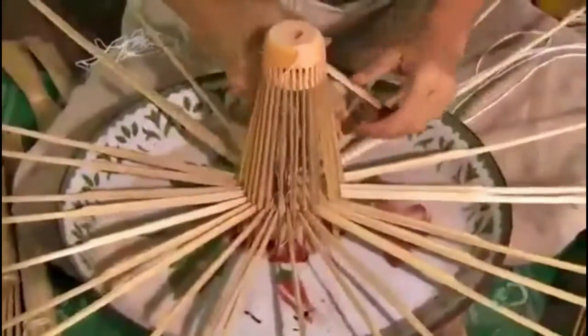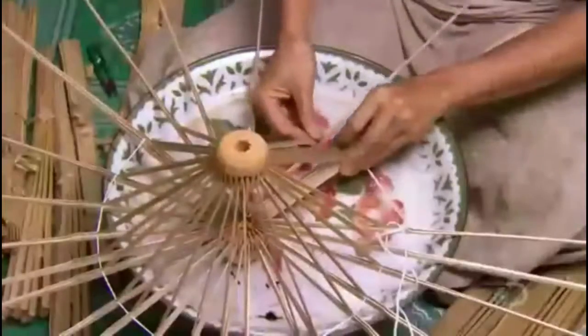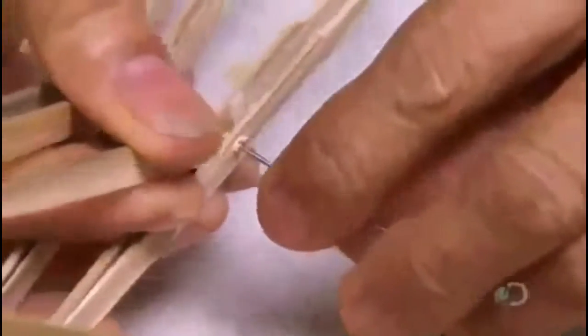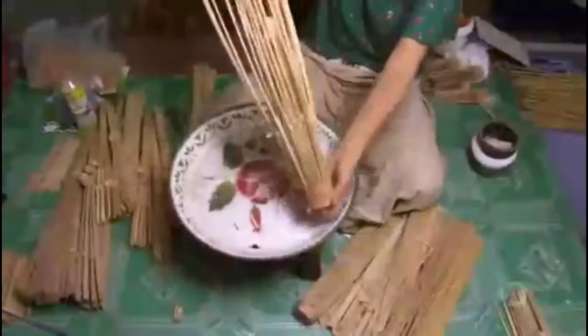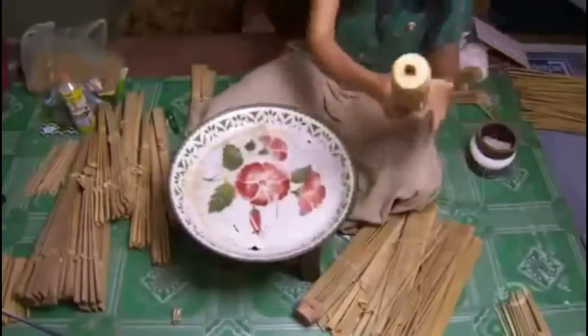Next, they attach the scaffold, a smaller hub with shorter ribs strung on it. They insert a scaffold rib into the slit of each frame rib, then attach them by threading a string through the aligned holes. The result? Raising and lowering the scaffold moves its ribs along the slit, pushing the frame ribs up to open the umbrella or pulling them down to close it.